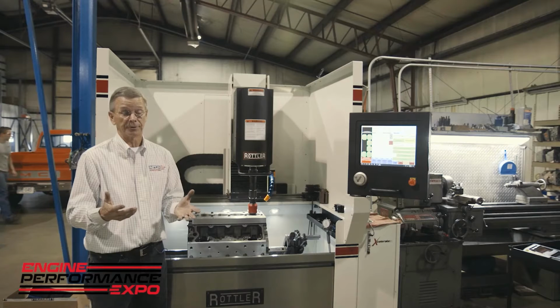So, for instance, in a blown motor or a turbocharged motor or a big nitrous motor, typical ring manufacturers, and I'm lucky enough to have dealt with Keith and Lake down at Total Seal, they've fed me a lot of information, and I learn something from those guys every day I'm around them. But they have told me that for big power applications or power adder applications, you're going to want RVK numbers 65 to 75. So those are some pretty big grooves or pretty big oil troughs in the cylinder.